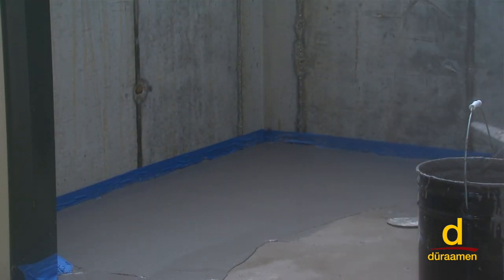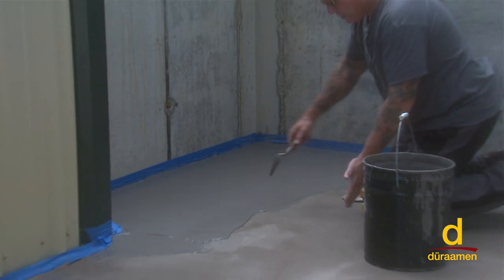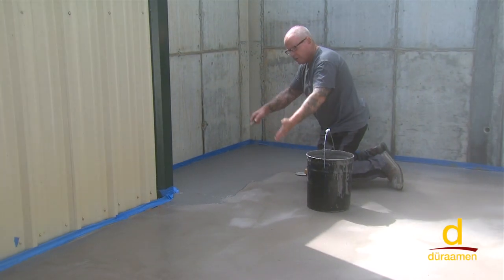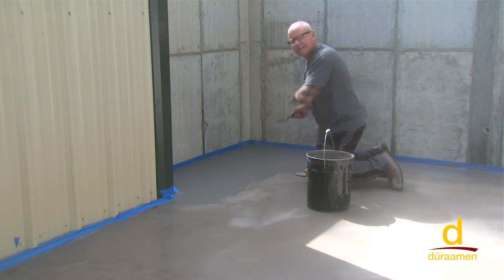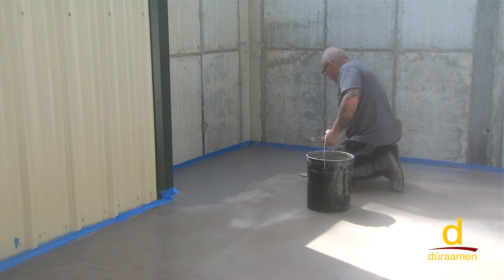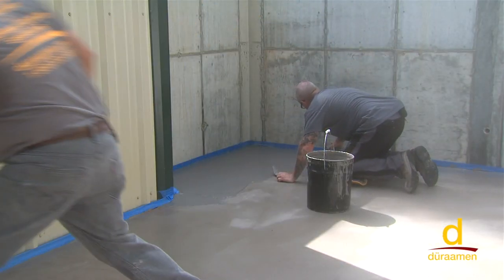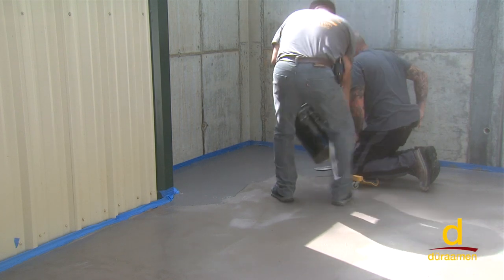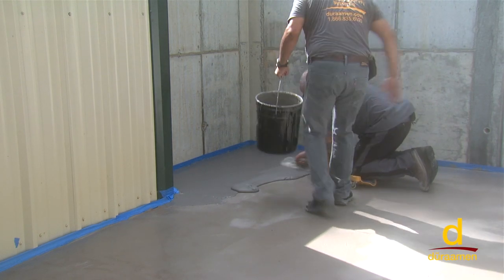Nice. So now what we're gonna do is he's gonna dump an area, so that broom is 24 inches in width, so we're gonna conceivably go 26 inch wide paths, and he's gonna continue to broom, I'm gonna continue to trowel. So let's dump some material right here.